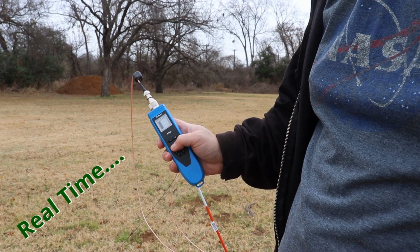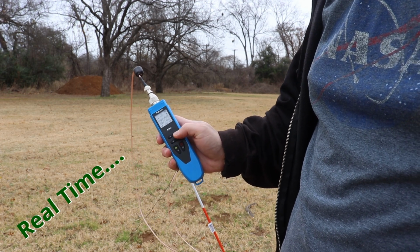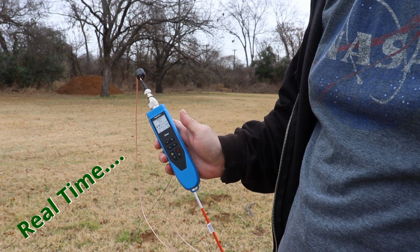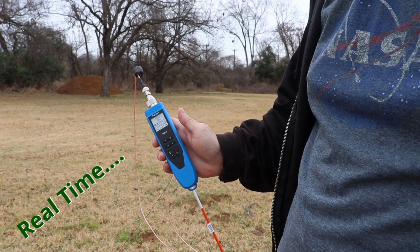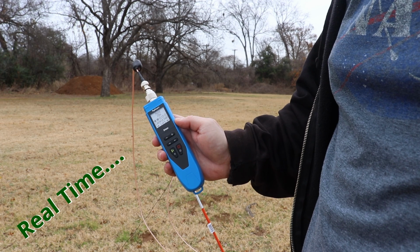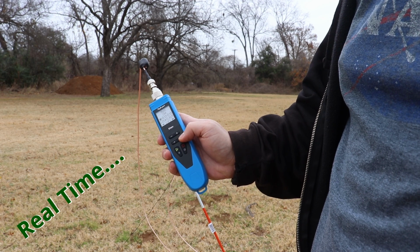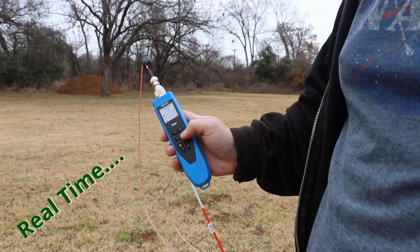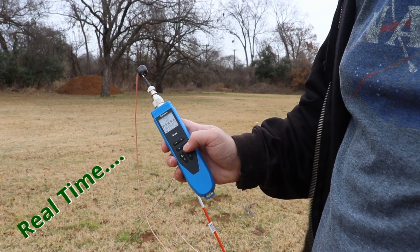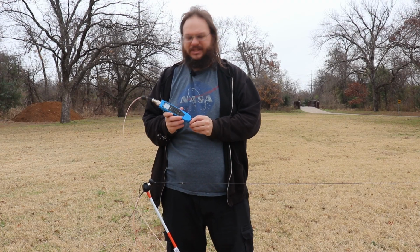We'll do 160. No. Let's go back to the home screen and tell it to do the multi-band scan again. So it's scanned and it's showing us that we have 5 good bands here. 20 at a 1.6, that is awesome. 15 at 2.25. 11, 10, 6 again. Overall, I'm very happy with the Rig Expert stick antennalyzer.